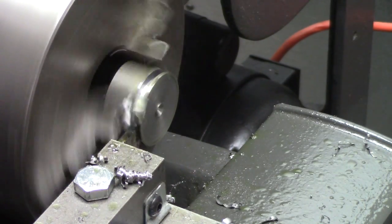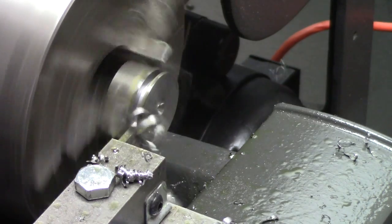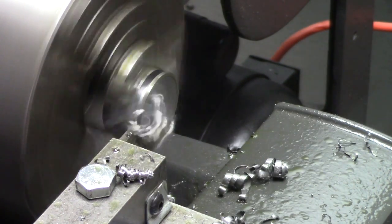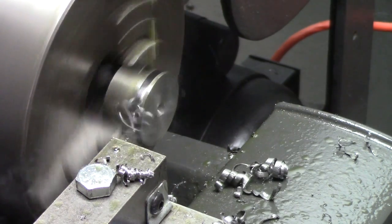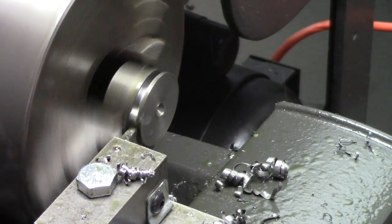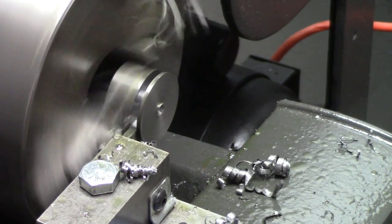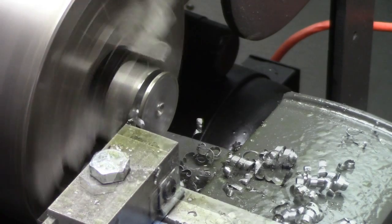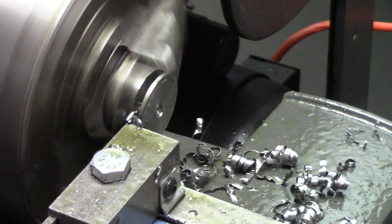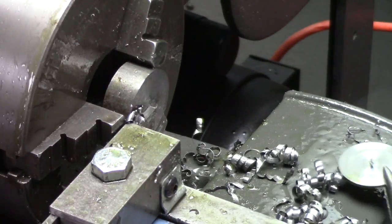At the auto feed, I'd say it's doing good — inch-and-a-quarter bar, 3/32 tool I guess, 1/8 inch. It bogged the lathe down a little bit but no other hesitation. Down through — there we are. Looks like a pretty good cut.